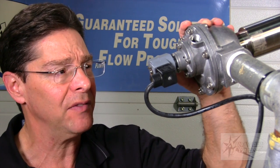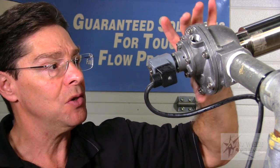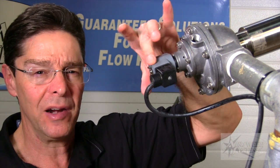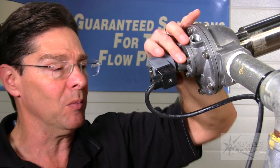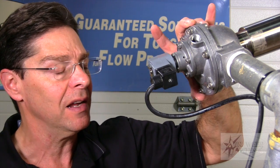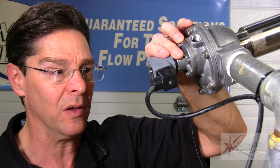Now we're going to take a look at the larger diaphragm valves that we use. This is an inch-and-a-half diaphragm valve connected to the VA-51 AirSweep; we also use it with the VA-12 AirSweep. It's got two diaphragms — a main diaphragm and an upper diaphragm — and then it's got the integral solenoid built in. We actually have to remove the main bonnet to get to both the main diaphragm and the upper diaphragm, and then we can also get to the solenoid and repair that.